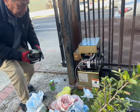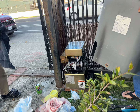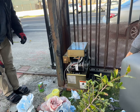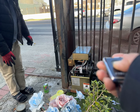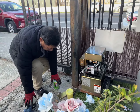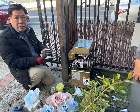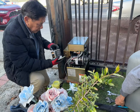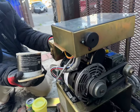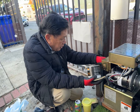Here's the wrap-up of the Eagle One half horsepower. The main complaint is it doesn't close. We did fill up the 90-weight gear oil on the gear reducer.